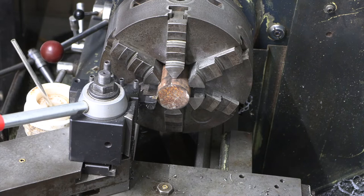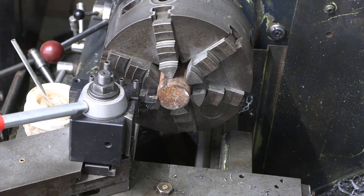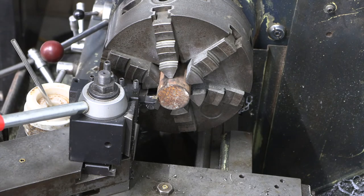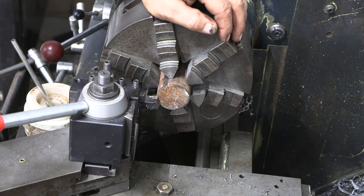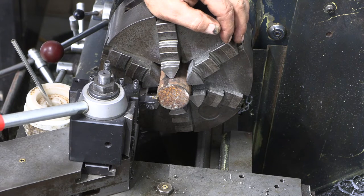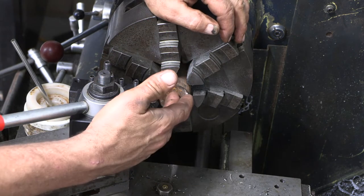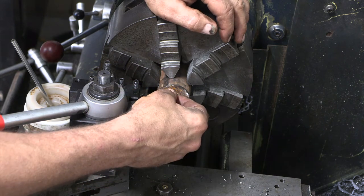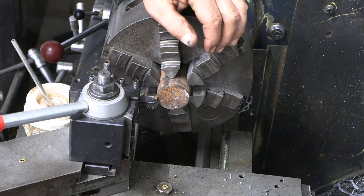Okay, so we're over at the lathe. I'm probably going to work this at about 570 RPMs. First thing we're going to do is get our facing operation done. That's the first thing you should do on every part. Sometimes I get a little ahead of myself and forget that. It's really no excuse. And then because we're going to have a lot of stick out, we'll go ahead and bore this for our internal dimension. Then we can support it and turn our part down to its final dimension.